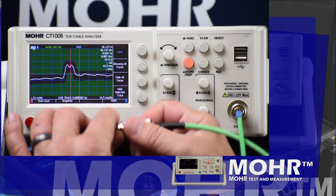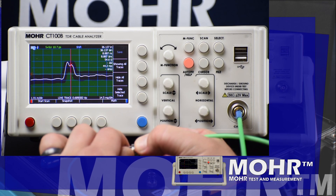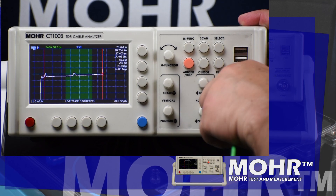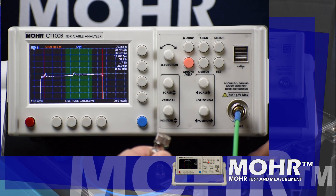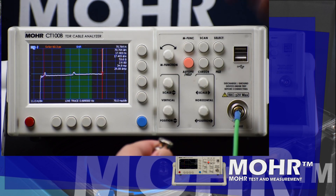As you can see, we can test the connector we traced. And when we disconnect the line, we get a fail indication. But notice when we add a device to the end, there's no change, since it doesn't affect the impedance of the line within the mask.